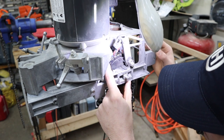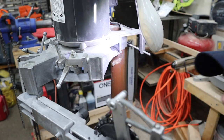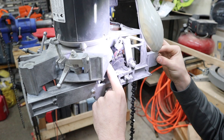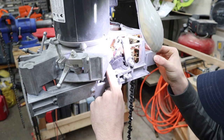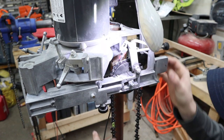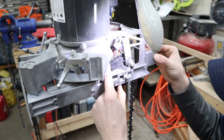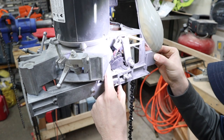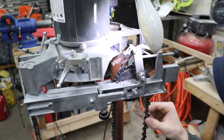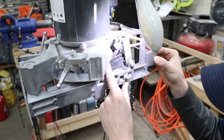Looking into this grinder, it's pretty impressive just the way it's made. The approach is a lot different than your round grind — you are certainly not bringing the stone down to the chain on this one, you're bringing the chain into the stone. One thing that's really crazy about square grind is that you grind into the tooth so that there's no burr. On a round grind you traditionally grind out of the tooth towards the cutting edge, but here it's cutting edge towards the gullet. It's really impressive just how a different profile on the chain makes it that much better.